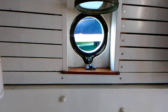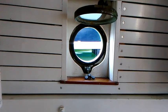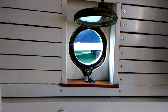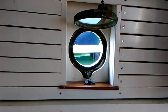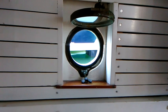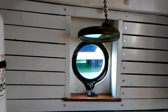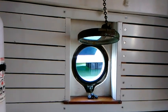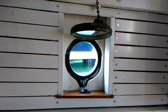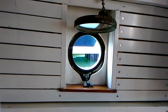That port light gasket is back in with the break up at the top, where water is very unlikely to leak in. And I put a little 4200 in there to seal that gap so that even if water does somehow blow up there, it shouldn't leak in. I think at this point I have completely eliminated the leaks — at least I hope I have. Fingers crossed.